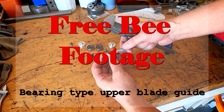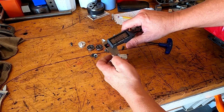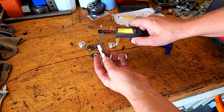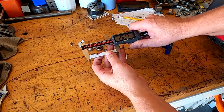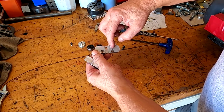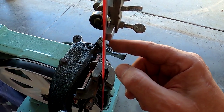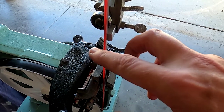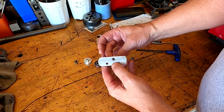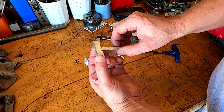Putting this together was pretty easy. I took a piece of three-and-a-quarter by half-inch bar stock, cut it to dimension — 0.371 by 0.590, total length about 2.8 inches. This piece, where it mates in, is offset on the cam wheels because it comes out forward of the blade. So those cam wheels, to have them centered, are offset on that pad — when this goes in, it's offset like this, which is what allows us to adjust in and out on the wheels.